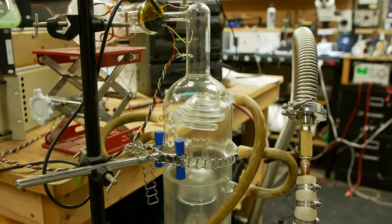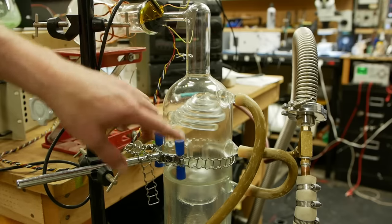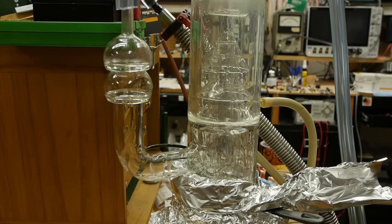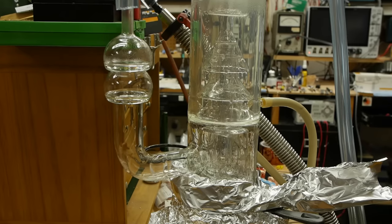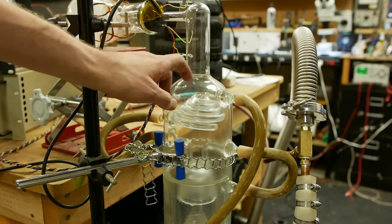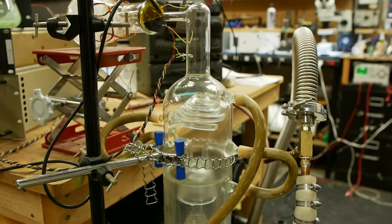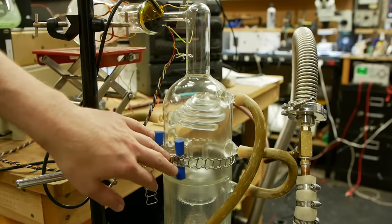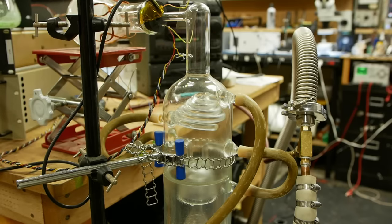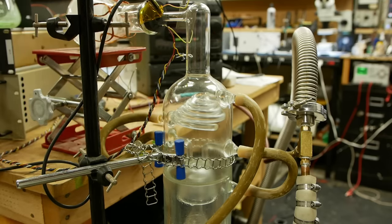Let me show you the internal structures of this vacuum pump. At the top here we have a cooling coil with water running through it, and the purpose of this is to catch vapor molecules that aren't well controlled by the bottom of the pump. We're boiling oil and we expect the jets to keep it very well controlled and condensed down below, but if any of that oil makes it up into our experiment that would be very bad — it would actually poison or contaminate our vacuum experiment. So this cooling coil up here is kind of a backstop, a safety of last resort. The coil actually makes an optically opaque barrier between the input and the pumping area, so if any stray oil molecules go up there, they have to contact the cold coils and get condensed before they make it out of the pump.